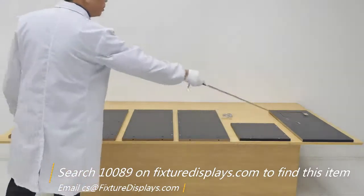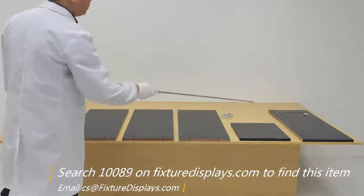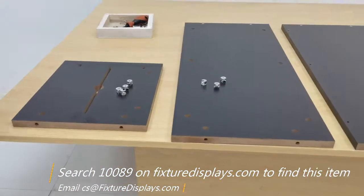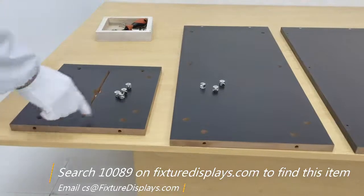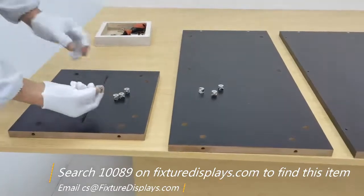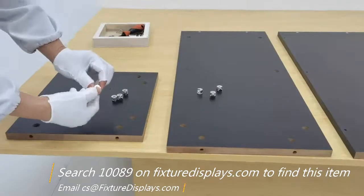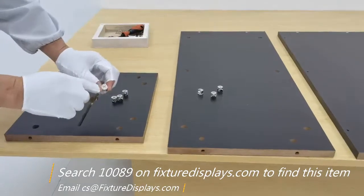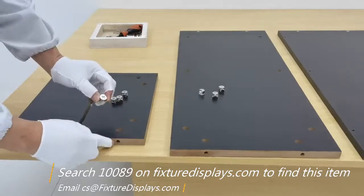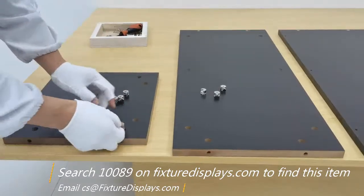These are all the components you have: top, back, sides, bottom, and the door panel. To begin, we want to identify all the parts and then insert all the cams into the holes. On the cam there is an arrow — make sure this arrow points toward the opening of the hole.